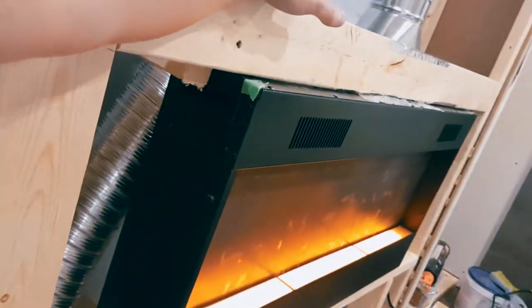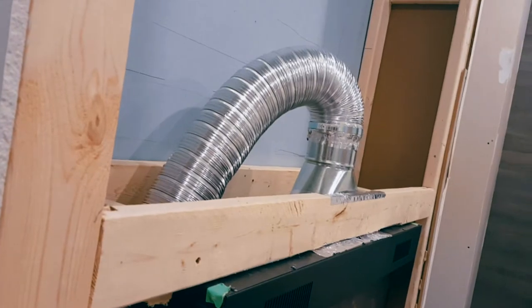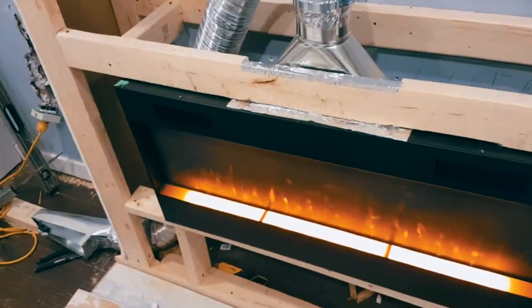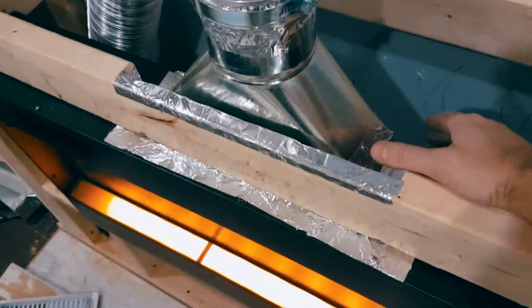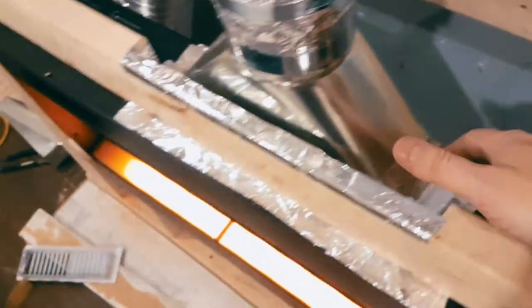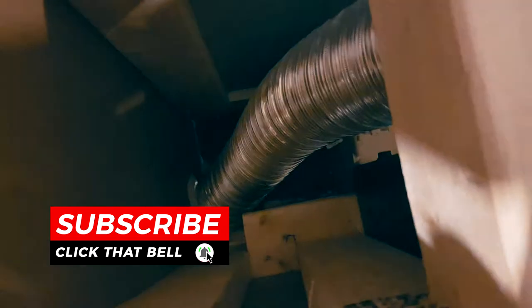The rest of the heat loss is from the pipe itself — at least that's my assumption; I'm not an electrician or HVAC specialist, so let me know in the comments below. At this point we have completed our venting and ducting setup. Make sure there are no leaks or drafts, double-check the pipe fitment, and get a bracket to attach the pipe to the wall so it doesn't move. Then we continue with the fireplace build.